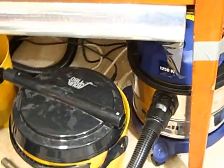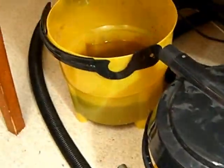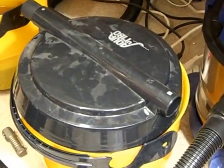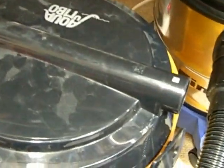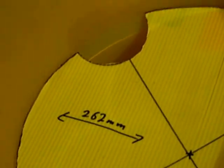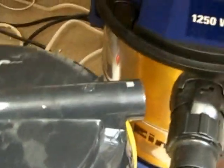I found a workaround for this. Basically what you need are two aqua jumbo buckets, which are already meant to be pre-filters for pet hair or ashes from the oven. I changed them a little. First I have a filter for very rough dust like metal chips or larger particles, and it works similar to a cyclone filter. There's a piece in between with a 262 millimeter diameter — I made it from corrugated plastic, but every material is suitable.